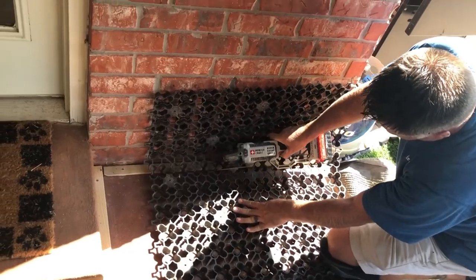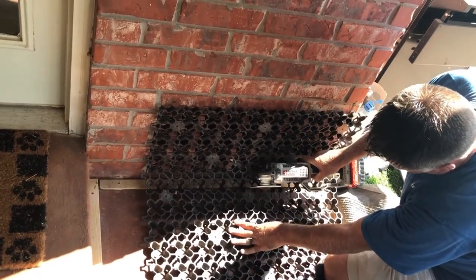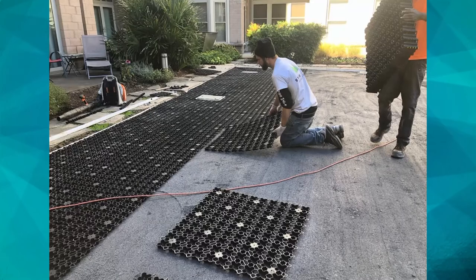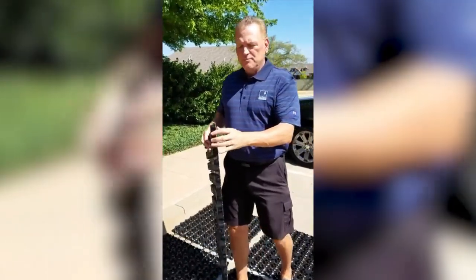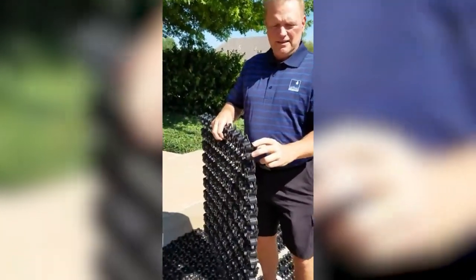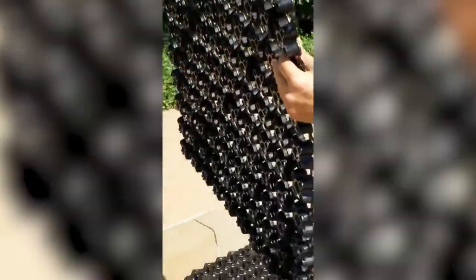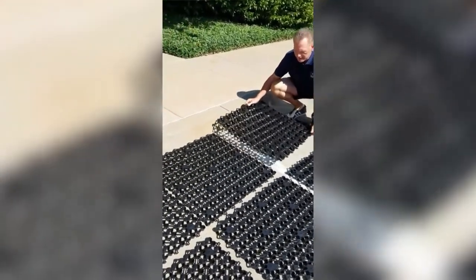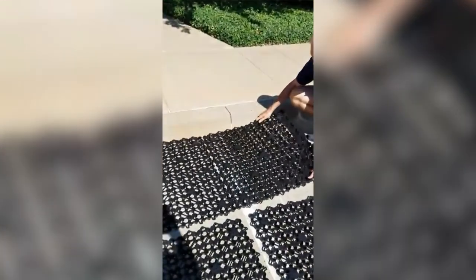Air Drain panels can even be shaped to the installation site as needed with the appropriate cutting devices. To begin installing, start wherever the longest strip or line of your installation site would be, moving from left to right. Each piece should be oriented so that the yellow indicator tab is in the bottom left corner and the flat side is facing up. Then insert the male connector into the female connector, and lightly pull to snap them in place.